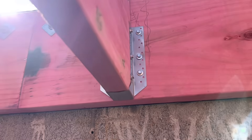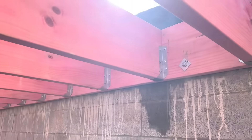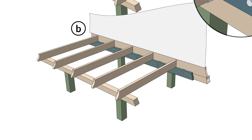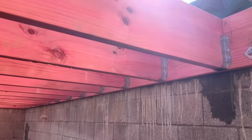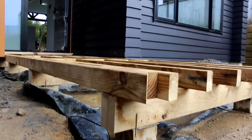As well as bearers, you might connect your joists to a stringer. Stringer beams are used where new floor framing connects to an existing floor or wall — their common use is constructing a deck on an existing dwelling. Your last bearer into the house can often be a stringer. When building a deck, we often decide what's going to be easier: a stringer or another row of piles — it's definitely a situational thing.